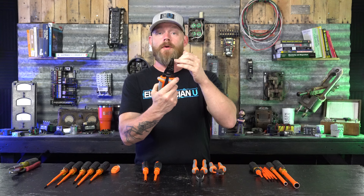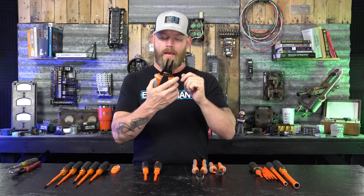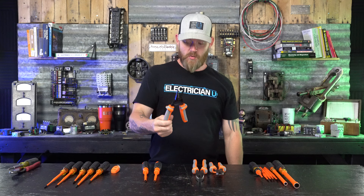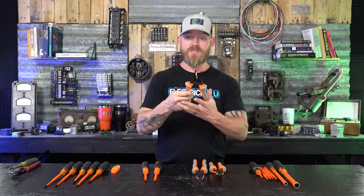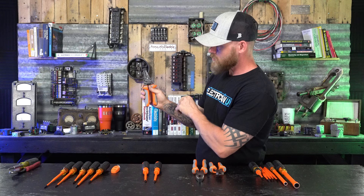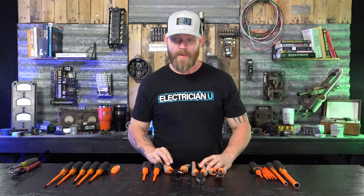They make lineman's pliers, side cutting pliers, and a set of strippers. These strippers are pretty much the same as a normal set — solid wire 10 through 18, stranded 12 through 20. Has a little hook bender and bolt cutters for 6-32s and 8-32s, just like any other stripper. Comes with a spring inside. I personally like ripping that spring out — that's just my preference. I don't like a tool being always open when I try to stick it in a bag. I keep my pinky down at the bottom and open it with my finger.